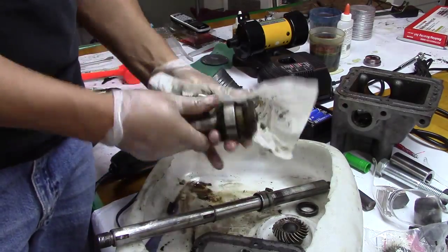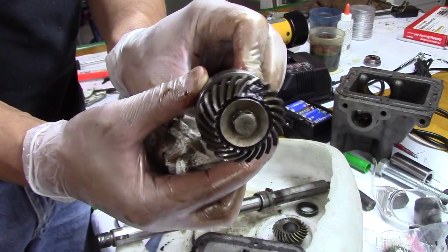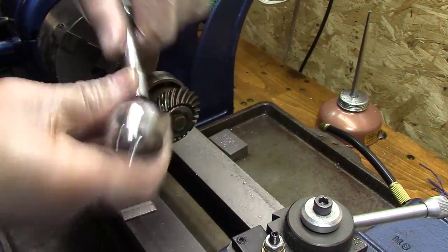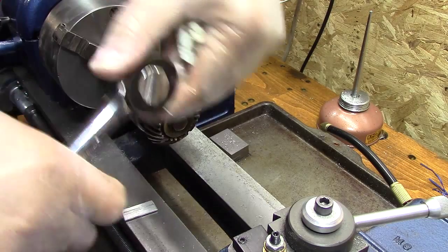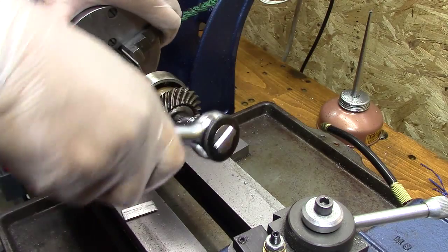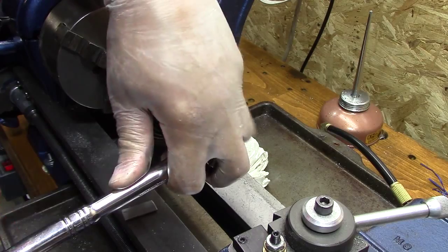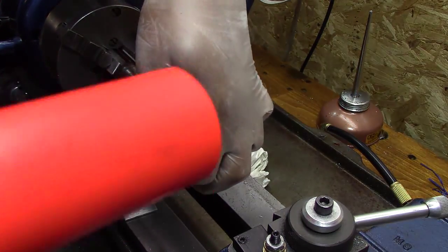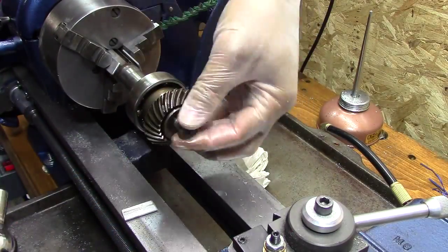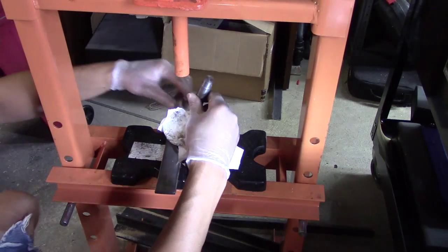Now came the struggle of how to get that broken gear off the shaft and the bearing. I thought and thought, and then realized — this is a round shaft, that'll fit in the lathe. That can at least be the vice to hold it while I get that nut off of there. A couple of wraps on the hammer and booyah, it came out. And yes, those were very light taps with that dead blow hammer, so it didn't put a lot of force on the headstock.